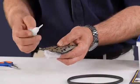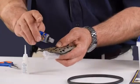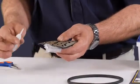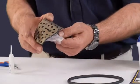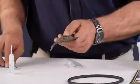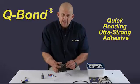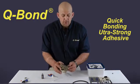It's important not to put the powder on right through to the bottom. Maybe do it in a two to three step layer. You cannot use your finger to put it underneath because the glue and the powder will stick to your finger, and also the chemical reaction will burn you. So it's important to put something underneath. What we do now is pull the piece of plastic out. We take the scissors to show the customer how quickly it's being repaired. We also explain to him that this can now be sanded and can be used to replace parts. A wide variety of items can be repaired with Q-Bond.